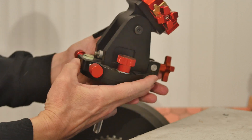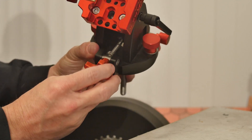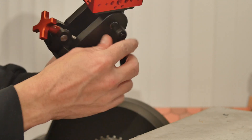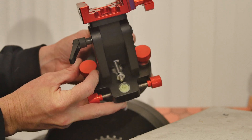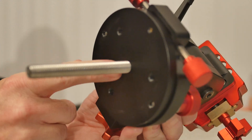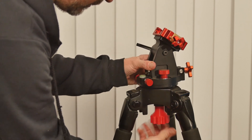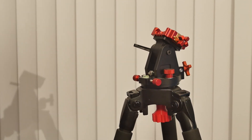I found this nifty little wedge on AliExpress, which should be about perfect. It's all machined aluminum and fairly good quality. There's a little bit of play or backlash or eccentricity in the altitude adjustment screw — not all that great, but it does work. It also has a locking screw for the altitude as well as locking knobs for the azimuth adjustment. I did make one slight modification, which was to drill out and tap a hole for a large M12 bolt so I could install it onto my Miller photo video tripod.